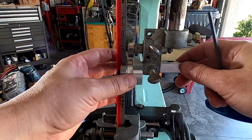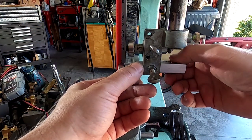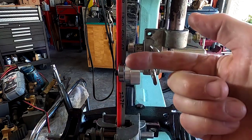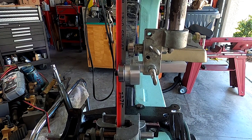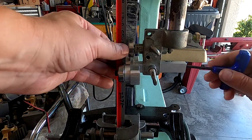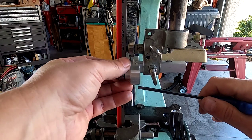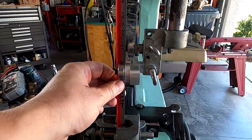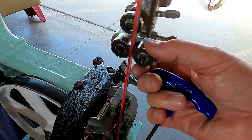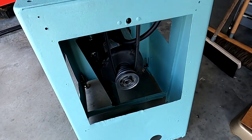To get it adjusted, you can move it in and out. I haven't made an adjusting screw yet so I'm just using this bolt to lock it where I want. Right there is where I want it, then you lock the depth in place. You can then rotate or cam over your bearings to where you're just starting to make contact and tighten them — one and two right there. Now we have a perfectly viable guide, just barely touching on both front and back.